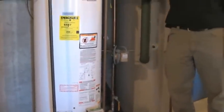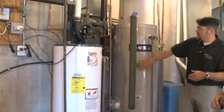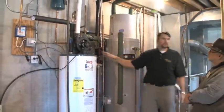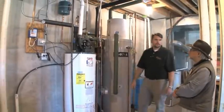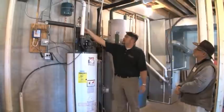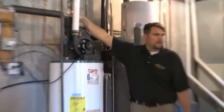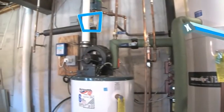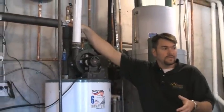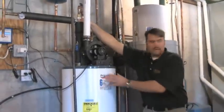In this case the water heater was already existing. To add solar water heating to a home you are typically adding a storage tank, differential controller, the collectors, and a couple of pumps — there is no need to buy a new water heater. One important thing to note: a tempering valve or mix valve is required for a solar water heating system. It's because you have the potential to send 150 to 180 degree water out to the faucets, which could scald, burn, or seriously injure someone. This valve automatically mixes cold water in so the output is always at the set temperature and never above it.